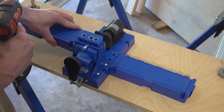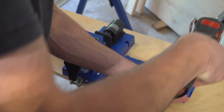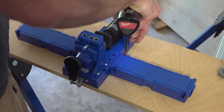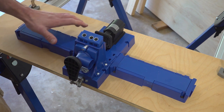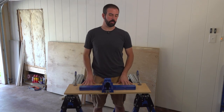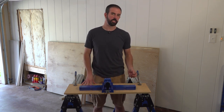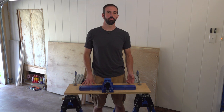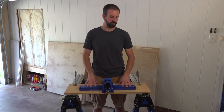Now you just drop these down in those nice little dovetails and screw them the rest of the way down. It's got 12 screws in it — I don't think this thing is going to go anywhere. Just for reference, I'm using three quarter stock for this and inch and a quarter drywall screws. It's a perfect combination because it's just thick enough that the screws won't protrude through and it's a rigid surface. It's not going to flex or bow on me with this system.